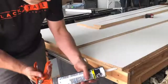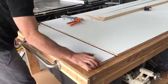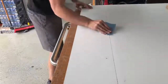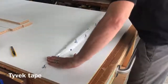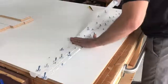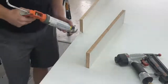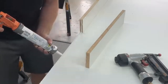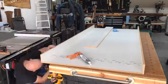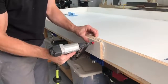This next tip is one I get asked about all the time: how do you make a mold bigger than a four-by-eight sheet of melamine? All you do is run a bead of caulk, get your extension wing and squish it in there, wipe a little extra caulk if you want to be careful, then come back with a few pieces of Tyvek tape or tuck tape — it's just house sheathing tape, brand doesn't matter — and it will be completely watertight. Add a little support piece, a little more caulk, and finish nail it in. I have a detailed blog and video on how to make a leak-proof epoxy table mold linked in the description.